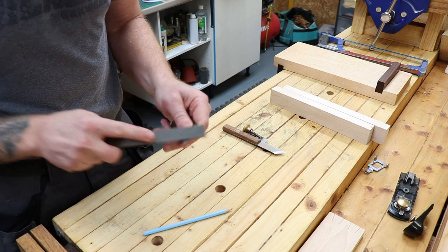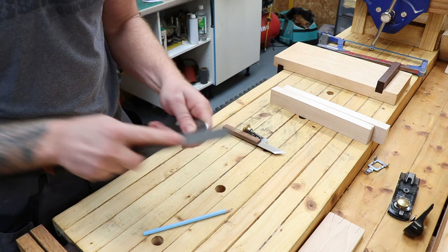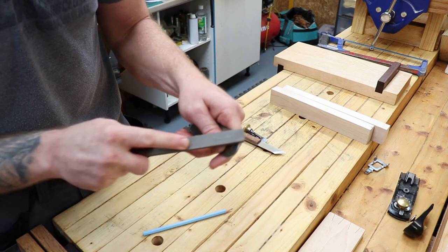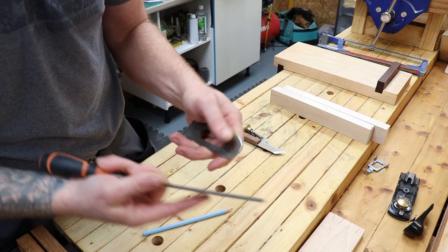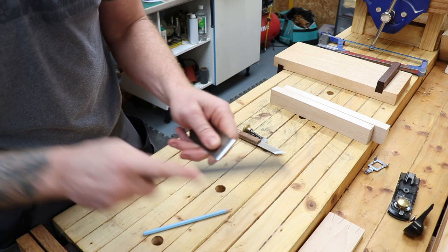The file will kind of skip off the tempered part, whereas back on the untempered section you can hear the difference — the file immediately bites in and starts to remove material pretty quickly. But on the tempered part it just slides off.